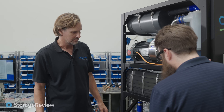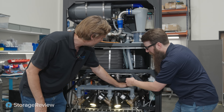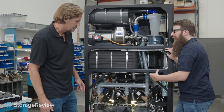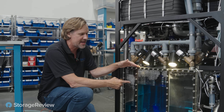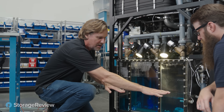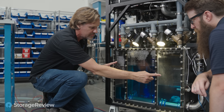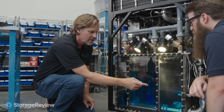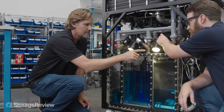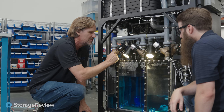It's pulling a vacuum on this manifold. This is the main pumping chamber — we call this the arm chamber. This is the auxiliary reservoir and main chamber. Think of these as two pumping chambers — like a free surface piston that goes up and down as it pumps. It's pulling high vacuum on these two chambers and low vacuum on the reservoir. When the main chamber starts to pump, it pulls fluid up. This solenoid opens and that's actuated by air — pneumatically actuated. That's the sound we hear when it's going. These are the valves opening and closing through the cycles.